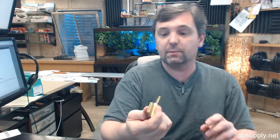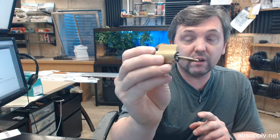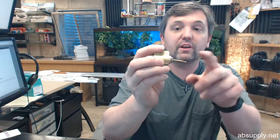If you care about what orientation the cuts are directed in when you install it, you might have to reverse it. Typical C-clip, that's going to hold the back of the plug to the cylinder housing, and you've got your tailpiece here. Reverse the process, that's going to go back down in. It can only go in one way. You're going to want to make sure that the face of the cylinder actually exits the plug. Put your inner rose back on, or your inner knob assembly back on.